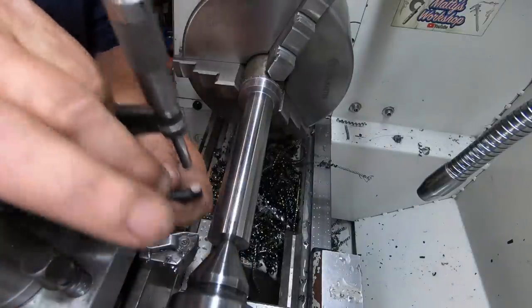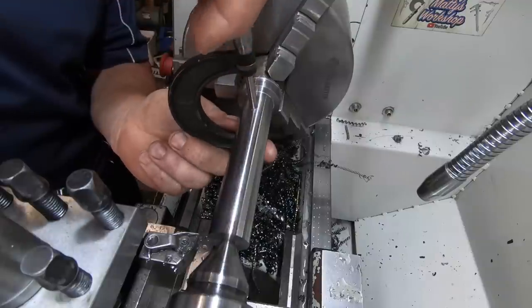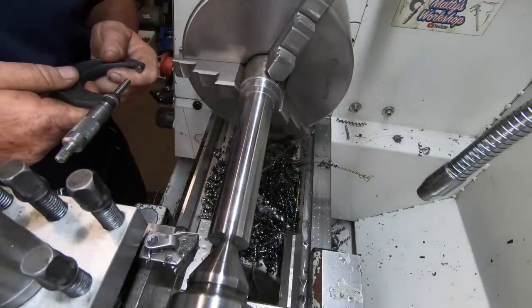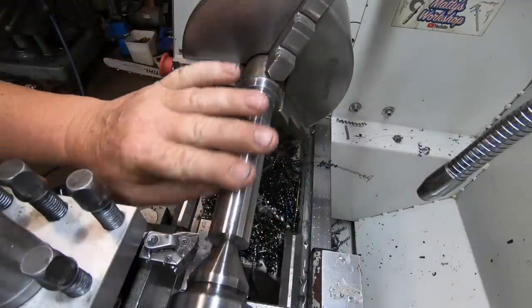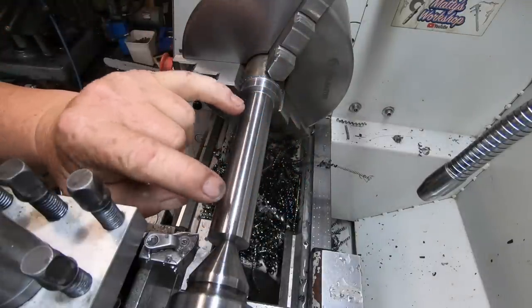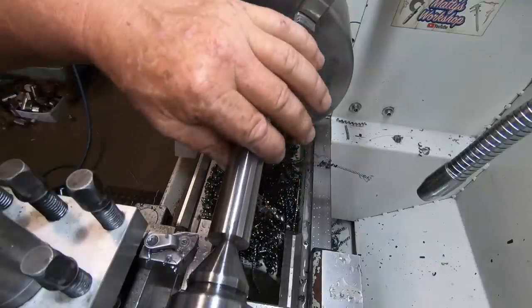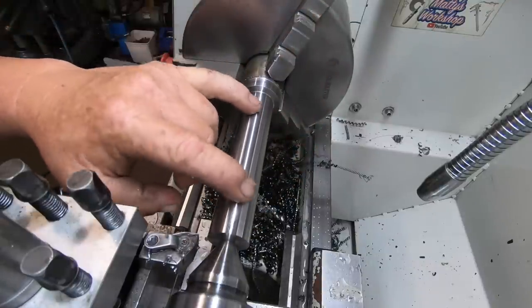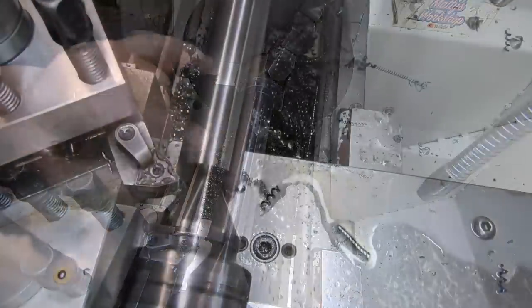Oh dear. 5 there under. Ooh. It's 5 thou under the inch, so if I've screwed up and made that a bit small, I have to make it again. I know I've got to have a little bit of play in it, but maybe that's a bit too much. But yeah, we'll just see how it fares once I get it together.